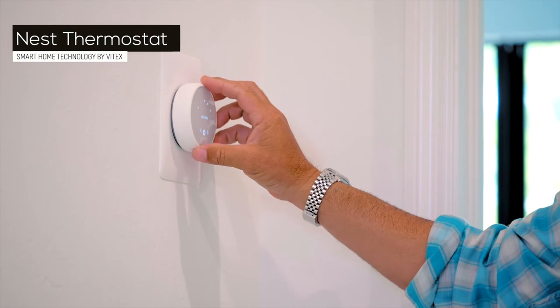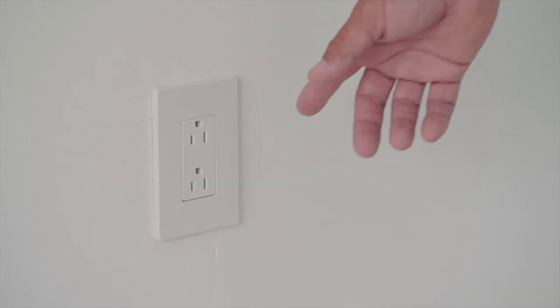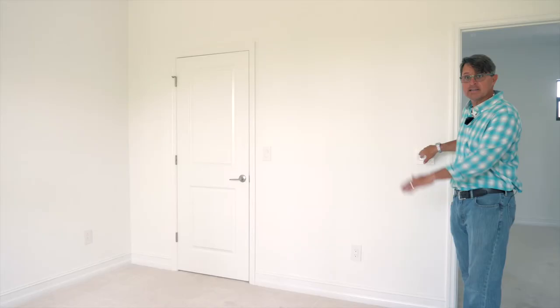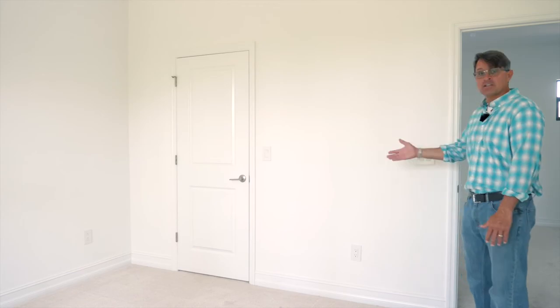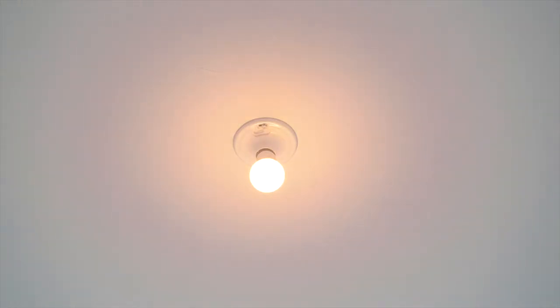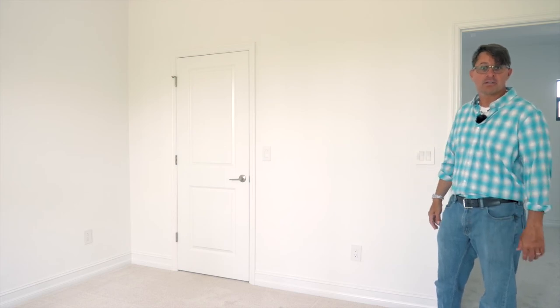As mentioned downstairs, your home does come with a smart thermostat — it is a Nest thermostat. When you contact Vitex, they will show you how to operate it as well as hook it up to the one app mentioned previously. In each bedroom you will see one upside-down outlet. It is done by design — it is not an accident. That outlet is controlled through the switch on the wall. If you plug a lamp into it, you would just turn this switch on and the lamp would come on; turn it off and it would go off. We also install a keyless fixture with a light bulb at the ceiling to let you know that it is working and functioning properly. If you install a fan on your own and find it not working, it is not because power doesn't go there — it is just a way for everyone to know that it is functional.